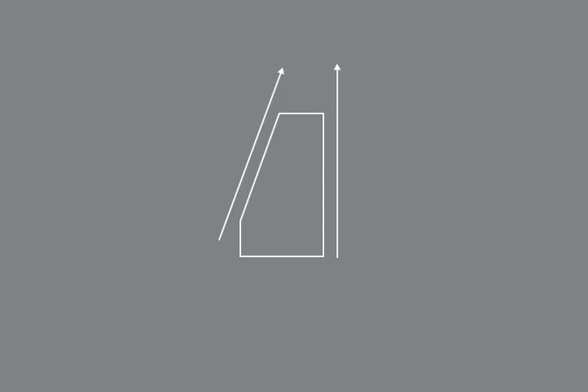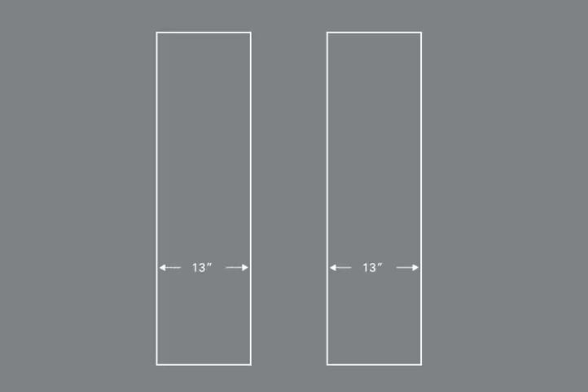So here was my plan. My pieces of wood were already cut to 13 inches wide, which is a perfect size to conceal the widest rack gear and the cords that will be attached in the back. Here are the cuts that I made. In this diagram, A is the bottom, B is the top, and the C pieces are the two sides.